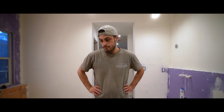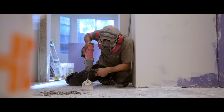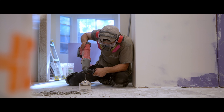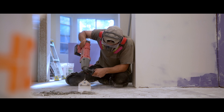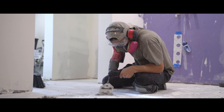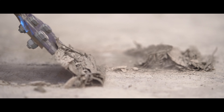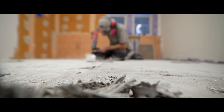I've got the demo done, well most of it. This floor is way too rough still for tile. We ripped out all the tile on this floor a few months back, but what we left was some thinset. Originally I thought I got most of it, but there's a very thin layer left, and even a small amount of unevenness can really throw things off when setting tile. I've made that mistake before, but never again.